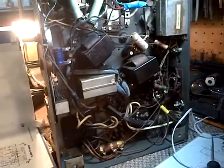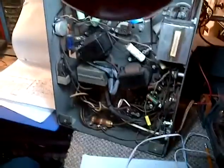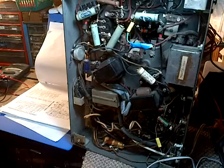So I think our move here is remove this resistor, explore the circuit that results, or lack of circuit, check this resistor for value, and that's got to be the terminal spot. That makes a lot of sense. It's in the right position, it's got the right kind of wires going to it. So I think that's our spot. It's an area I've been a little suspicious of all along.